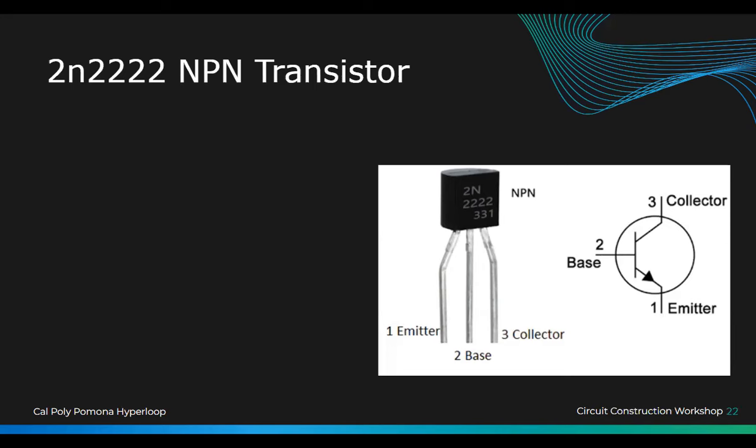you guys all know what a square wave is. So it looks like this, right? A square wave. When it's right here, this is 5 volts. And when it's right here, it's 0 volts, right? 0 to 5, 5 to 0. So if I put a square wave into the base right here, this base is your activator. If there is 5 volts in here, then current will flow from here to here. If there's 0 in here, then this will be open, so the switch is not on. The switch is on when this is 5 volts, or a high voltage.